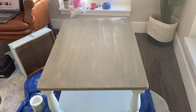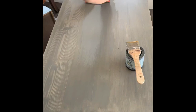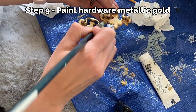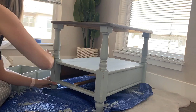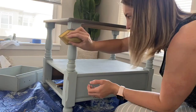Now I'm using my wood grain tool. This is the third layer of stain — I'm painting and then taking the gel stain away with that wood graining tool. I will link that tool in the description if you're interested in getting one. As you can see, it really adds a fun rustic look. For this project, I decided to paint the existing hardware using a metallic gold acrylic artist paint to give it a really nice pop. I did a couple of coats of that. Once I was waiting for that to dry, I went in with sandpaper and sanded down the edges and different parts of the piece to give it a really rustic, weathered look, and I'm really happy with how that came out.